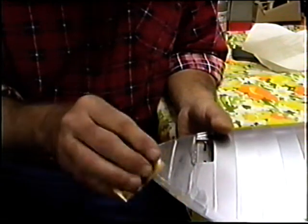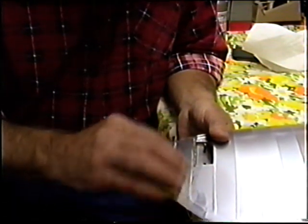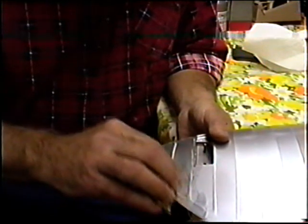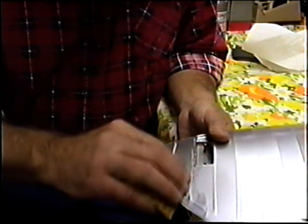By the way, a side benefit to having that Brodak primer on the rib caps is they really show up. As soon as I see that white coming through, I know I don't want to go a whole lot deeper than that. And I can get in all the edges and corners.